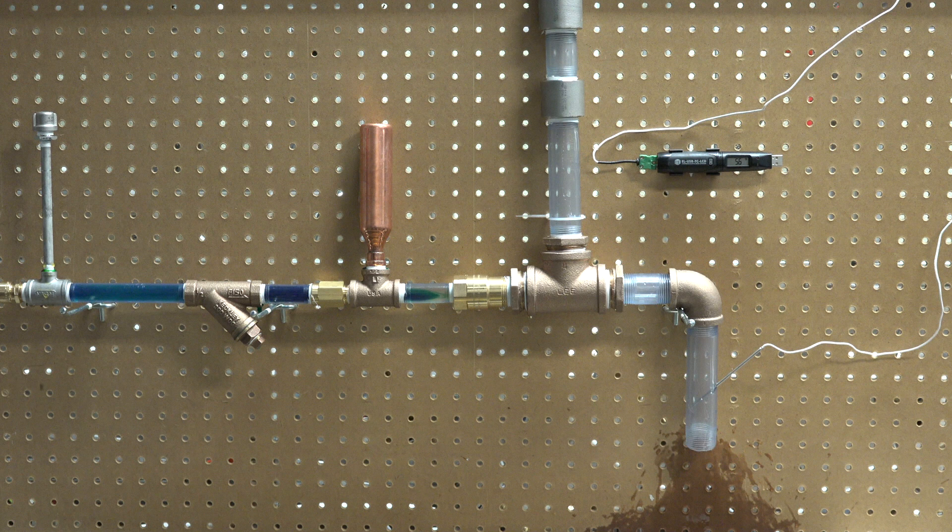Let's take a look at the DTV in action. The cold water line is dyed blue to show the moment that the DTV begins to modulate open, which only takes about 4-5 seconds after the set temperature is met. The set temperature of this DTV is 130 degrees Fahrenheit and is installed in the left side of the brass tee connecting the cold water line and drain discharge.